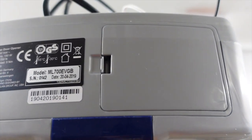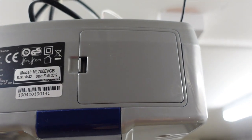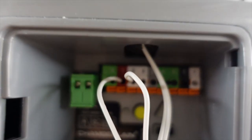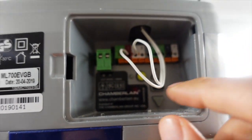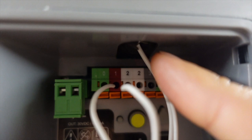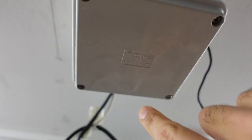Let's go up here and show you how this is wired up. The Shelly device is in this box here, and you can see there's a cable going back bringing power into the box. Opening this up — follow the instruction manual for your specific model. Mine's a Chamberlain model and these two wires are the ones feeding the Shelly device. One goes into port 1 and the other into port 2, and then these two feed upward through this cable and go inside this enclosure.